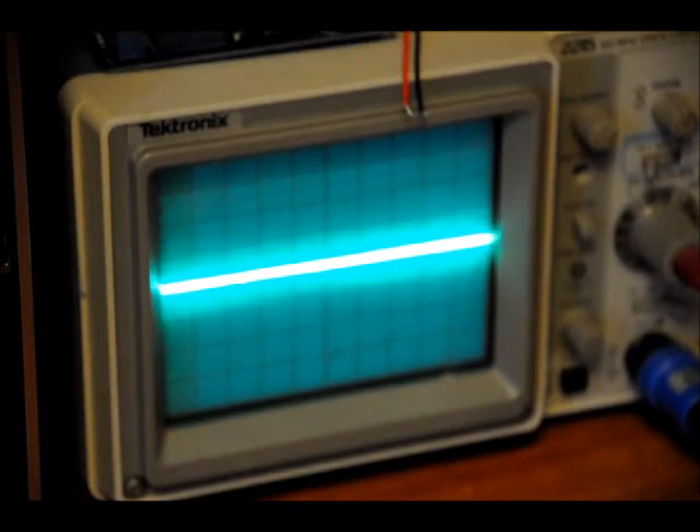So you have the option of amplifying your voice and using the analog signal for voice recording, or putting it up to a speaker as a tiny little preamp, or using it for clap circuits. If I keep turning the variable resistor all the way to the left, I make it even more sensitive — to the point where you don't see anything anymore. That's obviously too sensitive. So you can tune your analog gain and your negative reference point to work really well for a clap circuit.